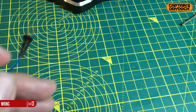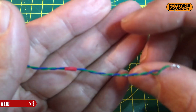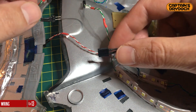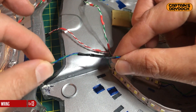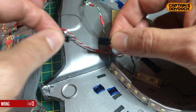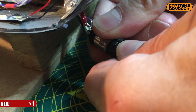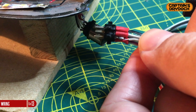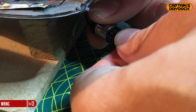Although I'm using connectors, this method is exactly how I've connected all my LEDs in this model, and it's very satisfying to look at knowing it's not going to short out once I glue the model together. The connectors are tight — there's no chance of them accidentally unplugging. For the master connection between the stand and the Enterprise, I'm going to use something called a DIN plug, which is mainly used for audio equipment, but I found these to be ideal for this type of project where I have five wires going into the model and require multiple connections in one plug. This will make it easier to take the model on and off the stand for storage.